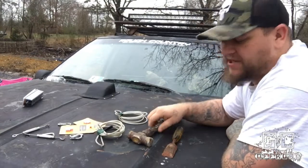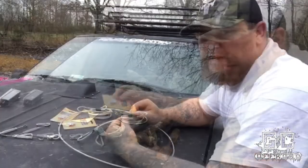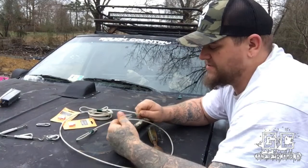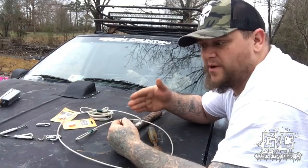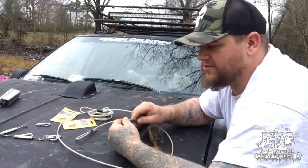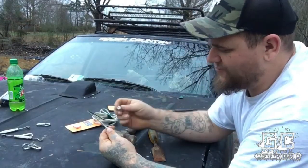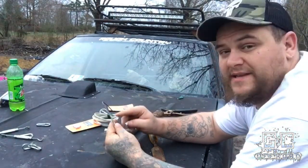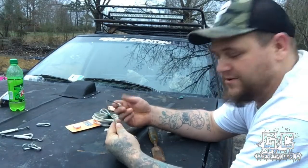Now, aside from those parts, I'll be needing a hammer and a chisel to set the ferrule onto the cable with. I pre-bent my cables to where they need to be bent and wrapped them in place with some electrical tape while I was setting everything up. That way I could just kind of throw everything on where it needed to be and know where the bends needed to be. Now, the line I'm using has a rubber coating that was not going to work with the ferrule I'd bought, so I stripped the coating off of it and now the cable will fit.